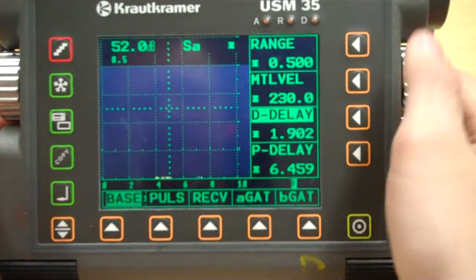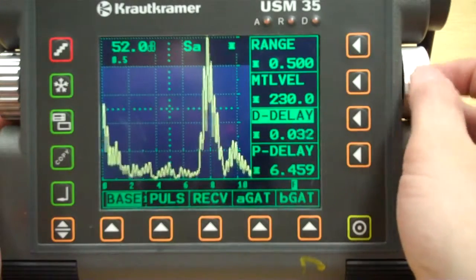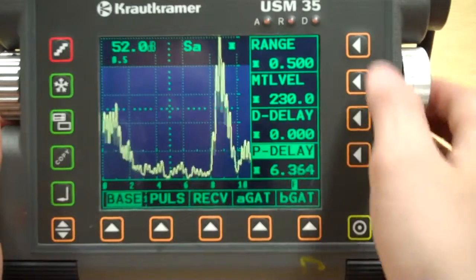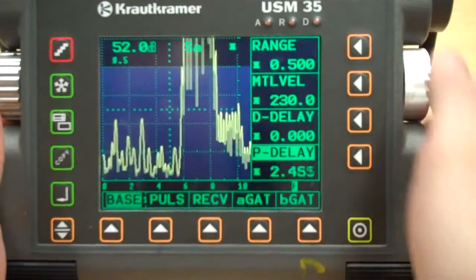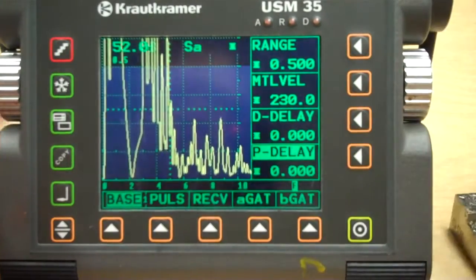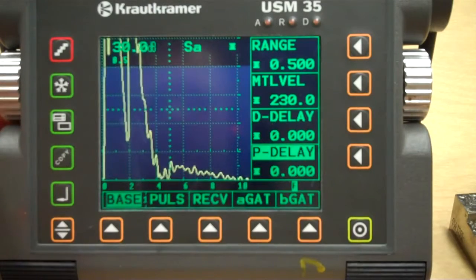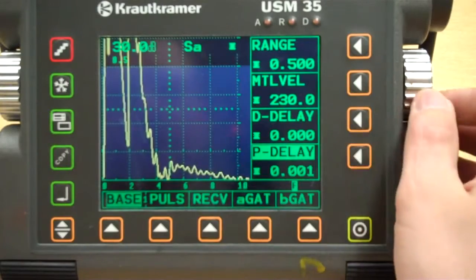Alright, bring all of our delays back to 0. Whoops. Actual 0, not negative 300 here. These knobs are a little messy here. Alright, so go and take him down to 0. Alright, gain, I'm just bringing my gain down to about 30 or so. 30 will be good. Now, if you were watching this, we're going to go through probe delay here.